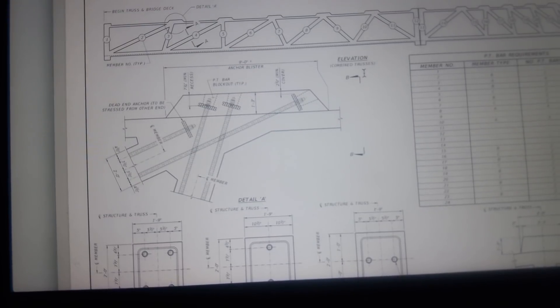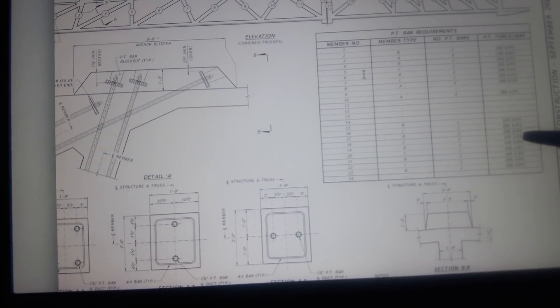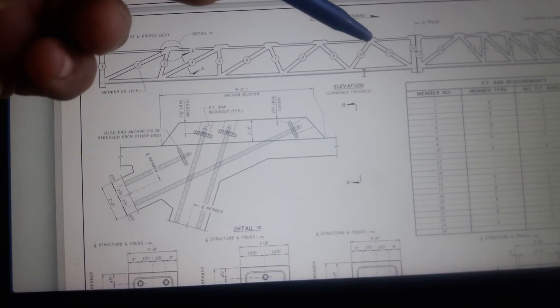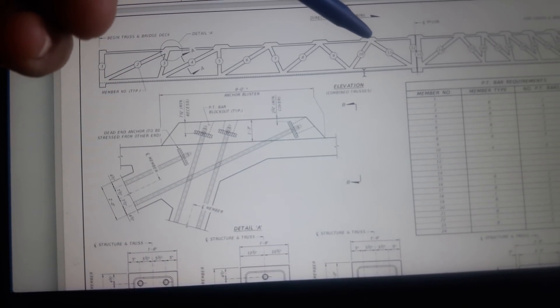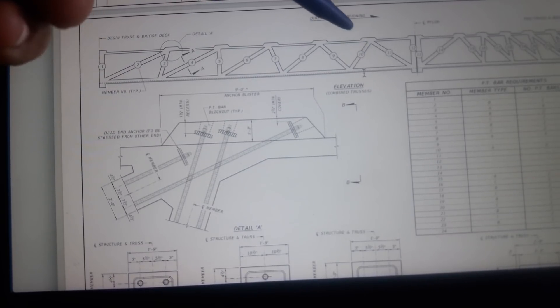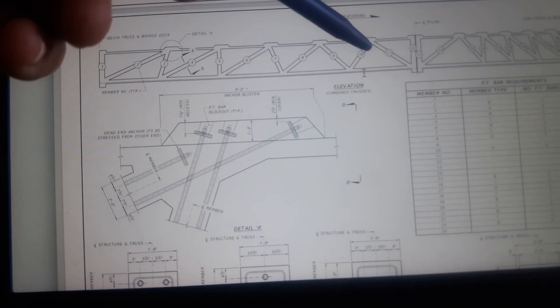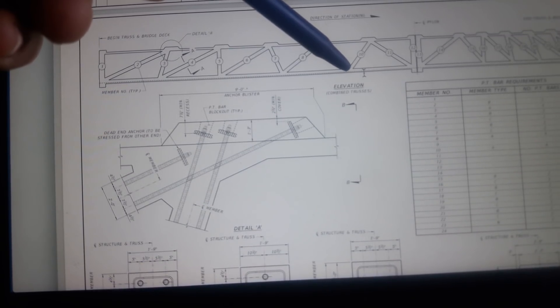Number 10 was designed to take 280 kips. As these forces broke free and this buckled — turning and allowing the forces to immediately release — this all transferred and caused failure of the upper canopy. Then it immediately transferred all that force to the lower canopy — like pushing a door open and somebody turns the doorknob: you've got all your force ready and you go flying across the room into the lower canopy.